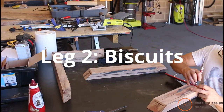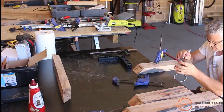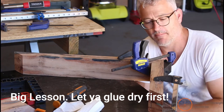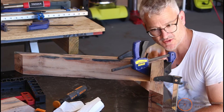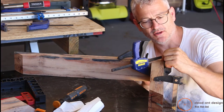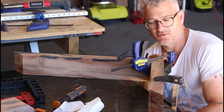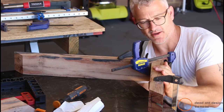Let's jump straight in. What I'm doing here is measuring up all the different pieces of the second leg, drilling them out, and getting all the biscuit holes drilled so we can glue and screw. I've glued this and clamped it and I've got a beautiful mitre joint now. On the last legs I didn't do it quite right — I immediately screwed in and tried to use the screws as clamps to hold everything while the glue dried, and that was a mistake because without the glue being dry it sheared straight away and I couldn't get it aligned. So this time I'll let the glue dry, then put the screws in — they'll just act as a strengthening force in case the glue comes loose, which it shouldn't because I've got biscuits in there as well.